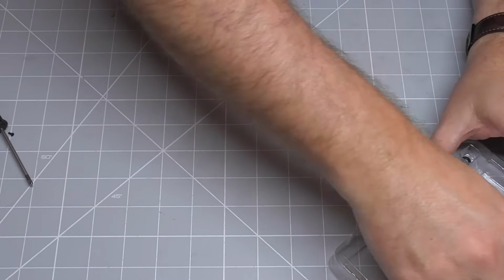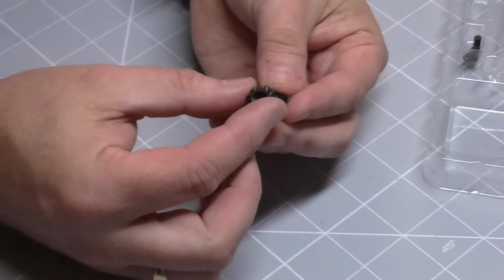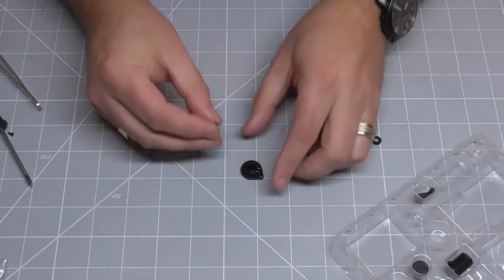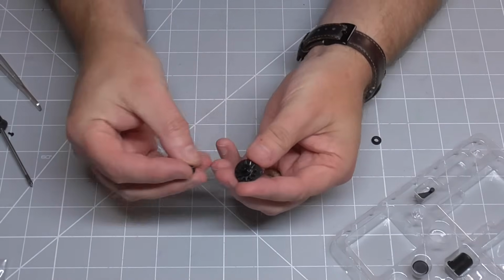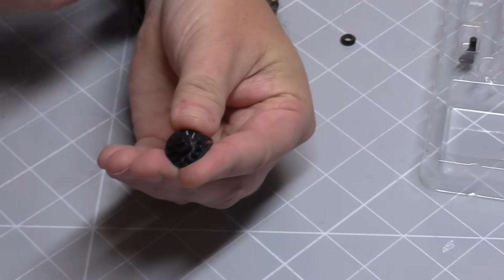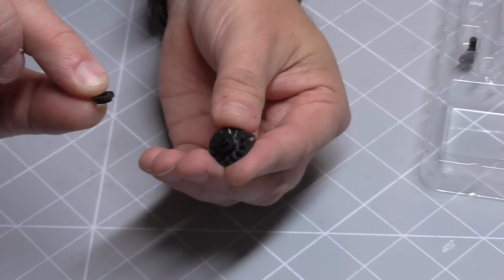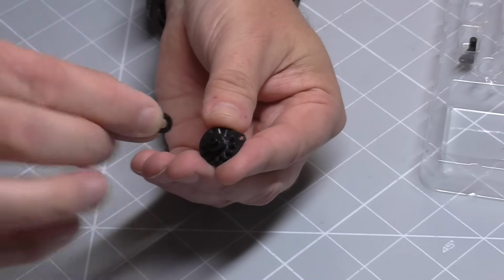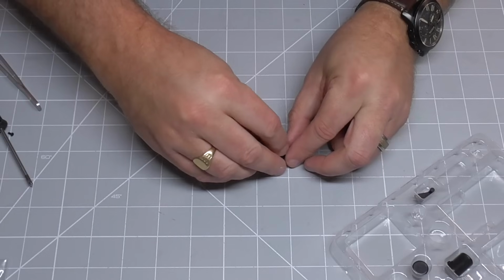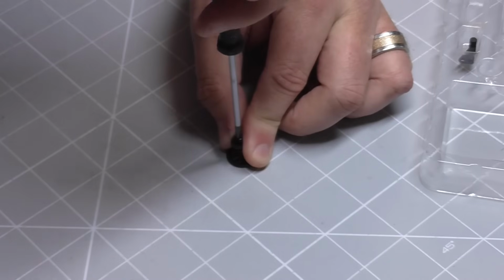We're now going to be making the alternator. So for that, I need this base plate here and put the first gear on. Now the gear goes on this way with the lip facing upwards, as you can see. Then I've got 2 pulley sections to put on. We've got one with a thick base here, which goes on this way, and it fits in like that. And then the second one with the lip facing down, like an upside down top hat, that's going to go on top. So it gives that effect to the pulley. I need to hold all of them together with a TP screw. These are those flange screws again, and make sure that goes in nice and tight.